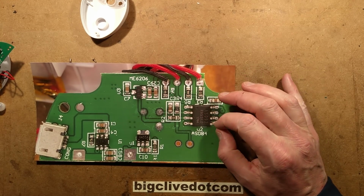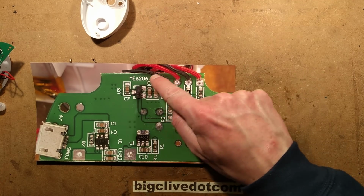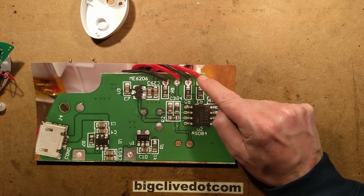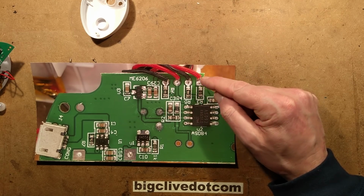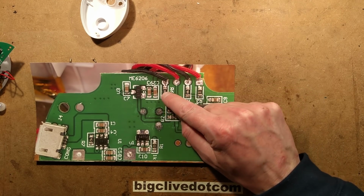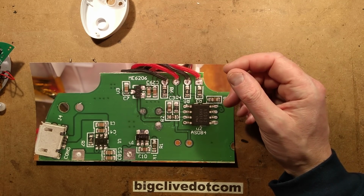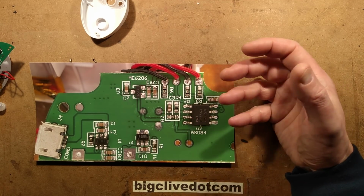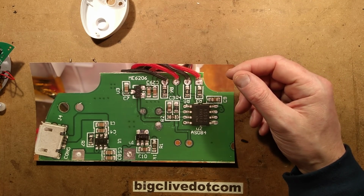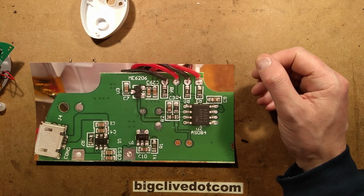That button input, the lithium power supply, well, the 2.5 volt supply, and then switching the 3 LEDs with a common for the LEDs, and then a resistor per LED. Noting that there's a 0 ohm link here, and the other ones are 10 ohm. I'm guessing that might be the higher voltage LED, just to say, for instance, that could be green. Not sure. Doesn't help when they've just used black, red, and one of those will be the common connection. And the others will be the colours probably being pulled down to the negative.